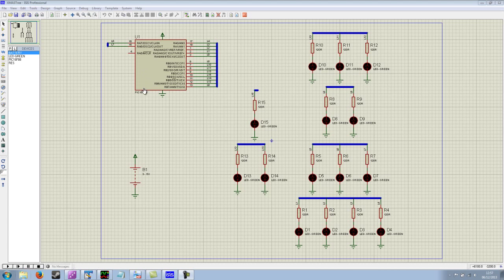I've used a PIC 16F88 processor, and this has 13 I/O lines, and there's an additional two that are tied to the oscillator. This device has an internal oscillator, so that gives us 15 output lines that can be used, as seen here, to connect to each of our 15 LEDs. Each LED is connected through a 120 ohm resistor, and then it goes directly to the microcontroller pin.